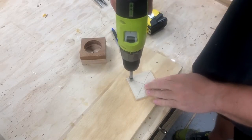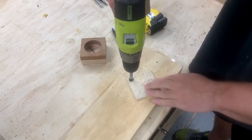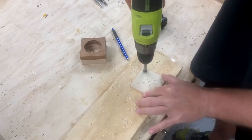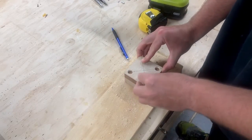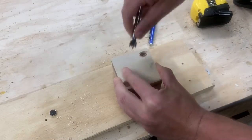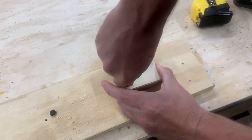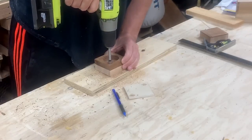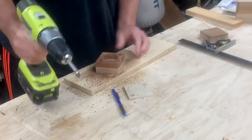I'm going to hold the top and the bottom together with two half-inch neodymium magnets in opposite corners. The easiest way to space and align the top and bottom is to make a template that's the same length and width of your box. Measure and drill all your holes, then use a half-inch drill bit — preferably a Forstner bit — to mark the center of the holes. After that, just drill your hole to the proper depth. I opted for the drill a little bit, check, drill a little bit, and check method.